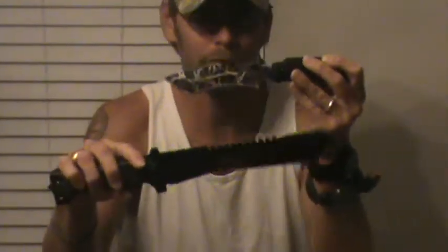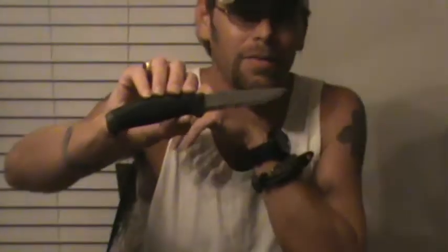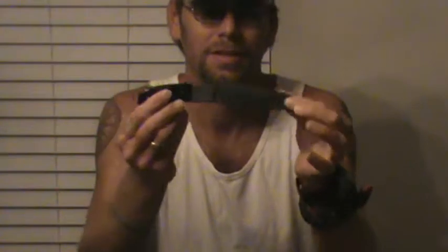But these have two totally different kinds of tasks involved when you're going to buy it. So you have to know that going into it. This is a Scandinavian kind of steel, out of Sweden. So it's meant to be really rust resistant, but at the same time, it's not going to be nearly as strong. This is a Damascus steel. This has 1095 high carbon steel and a 15N20 steel. So two ridiculously awesome steels.